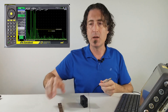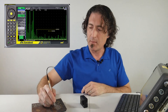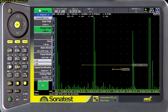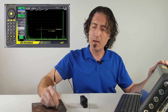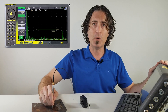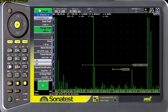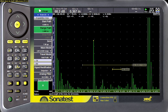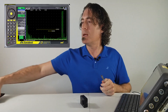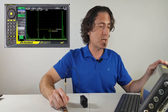Something else to take note of when you're using pen probes is the amount of wear that the tip goes through. Right now, this is a 0.375 plate — if I put the probe on the plate, it measures about 0.372, so that's fine. As we work and scrub around with the pen probe and take readings inside of corrosion pits, the pen probe will wear down. It's important to check your calibration all the time, because here it said 0.372 before, and now it says about 0.364 — we've lost about 8 thou in just a few seconds of inspection.